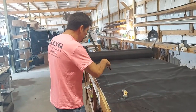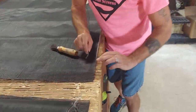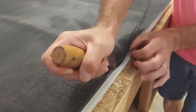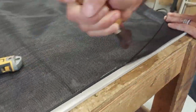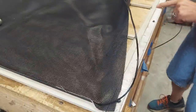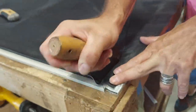Now we're just going to go ahead and put it together like we normally do, coming up on my front side. Our spline — in that straight line, I like to use my fingers, just spread that out, put it in place. I use my left hand to just drag it, making sure I'm dead center on all my crossbars. The reason I'm dragging my hand is I want to make sure I don't put any wrinkles in my material. We do not like wrinkles in our solar screens. I'm just going to verify that I'm in the dead center of each one of these, turning the corner, dragging it — because I do not want a wrinkle in my solar screen.